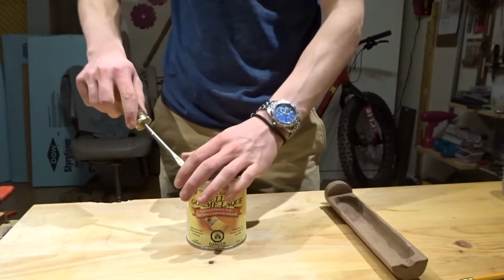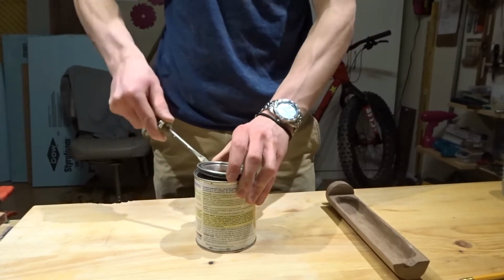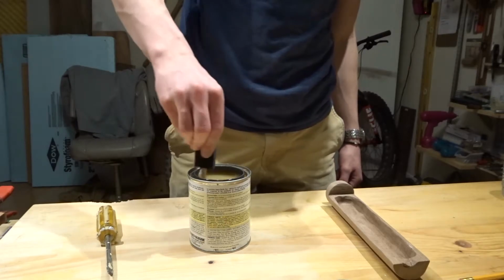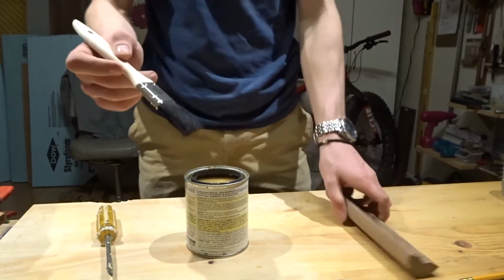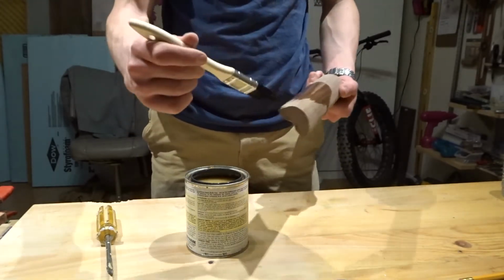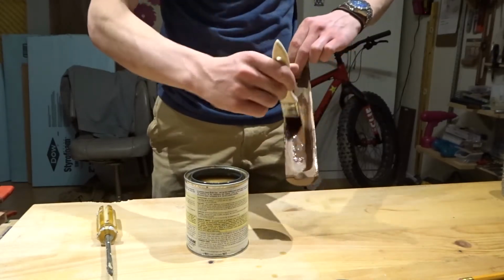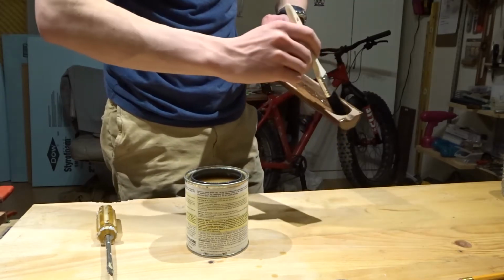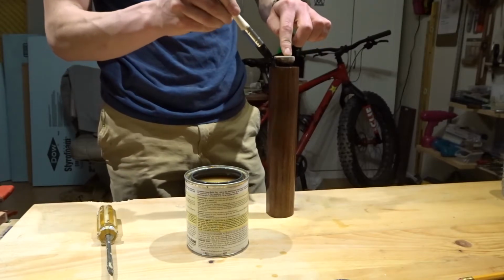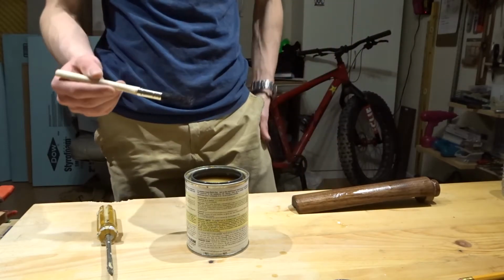So I'm using my new favorite sealer here, and I'm making a Christmas gift that had to be completely waterproof, and so that's why I got this shellac. And I realized that it's also food safe, which was also something that I needed, and that was for the same gift there. But I actually really like how easy it is to go on, and usually I've noticed with 2 coats it's going to be fairly shiny and really smooth as long as you do it right, and those 2 coats can be done within 45 minutes of each other, and then you just leave it for about an hour.